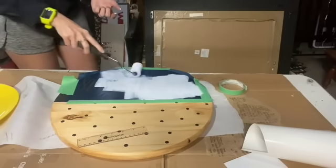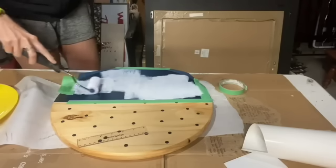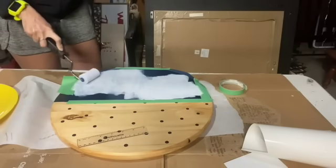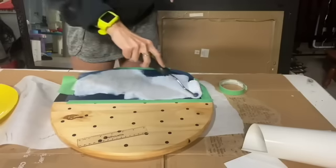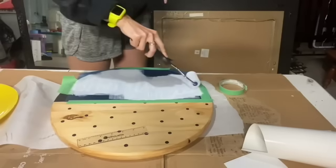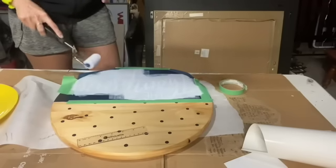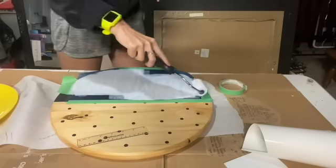And then you'll see me go back and do the same technique, where I just roll the brush on everything so that I can even out the paint texture so that you don't see all of my roll marks. I don't think I'm explaining that right, but this ended up taking 3 coats of white chalk paint. See how I'm just going nice and slow back and forth, because the end of that roller will leave a line mark. So if you put different pressure down while you're rolling it, you'll see that line through the text. I think that was a better explanation. So I always go over it lightly and try to even out everything I just did.